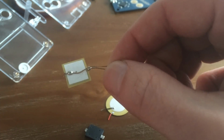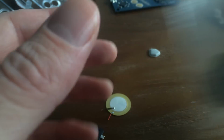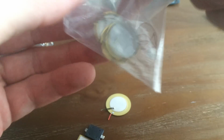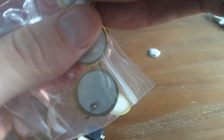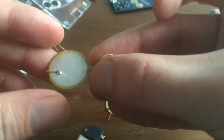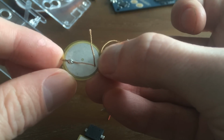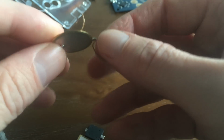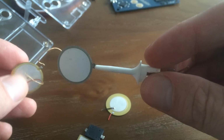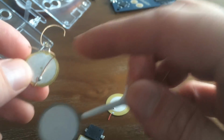We found these square elements, pretty cool. And we actually ended up going through the factory and picking out various different samples, trying everything. The one that ended up working really well was something that I didn't even know existed before, and it's a double-sided piezoelectric element. So you have the ceramic on both sides, so you have electrodes on both sides. When I went through the market, I saw these just on a shelf, but I didn't need the wires. I wanted just the bare metal, the bare element, and they had it, but it was in aluminum. So using my very limited Mandarin skills, I had to communicate that I wanted it to look like this, but made with brass.